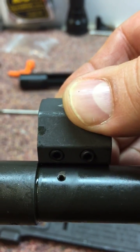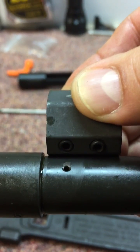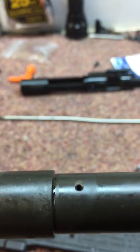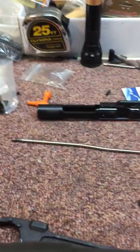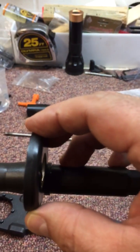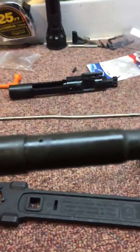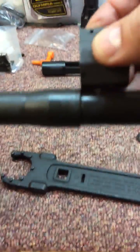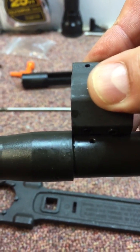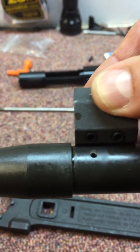So I would have to set this gas block forward a little bit. The reason for that is a lot of gas blocks are machined to clear the sheet metal spacer that you normally would have in between your gas block and your handguard. So removing that sheet metal spacer — in the case of a low profile with a free float — you now have that issue where you must space the gas block away just a tiny bit, the thickness of that sheet metal plate, in order for your hole to line up.